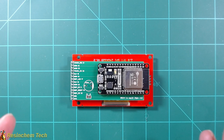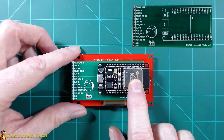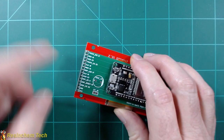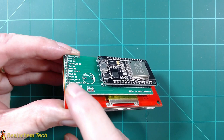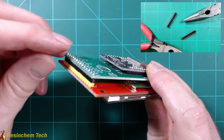Assembly when using the PCB is extremely easy. All you've got to do is take your ESP32 — designed for the 30-pin NodeMCU style — line it up with the markings on the PCB, drop it in, and solder it into place. Then line up your pins on the display and solder those into place. The pins on the display are actually quite long, so to keep everything more parallel it's helpful to add another row of spacers. I just took some pin headers, used needle nose pliers, gently pulled the pins out, and inserted them to relieve stress on the pins.